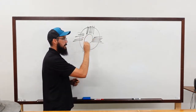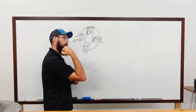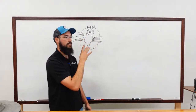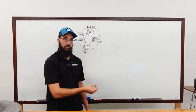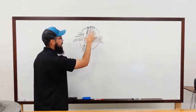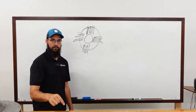You think, okay, magnets attract, and that's what we're trying to do. No, actually, most of the time with mag bearing tech, we're using the repel side of the equation. Each of these is generating an electromagnet, and our shafts are typically a permanent magnet, and they can demagnetize, which will cause all kinds of its own issues, and it is a problem that Turbocors have. Anyway, each of these magnets are working in unison with each other through the PWM module. That PWM module is the bearing control module inside of this compressor.